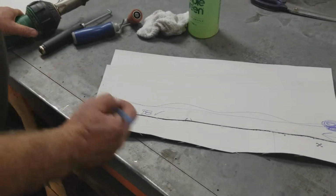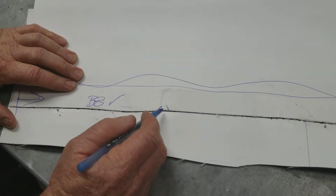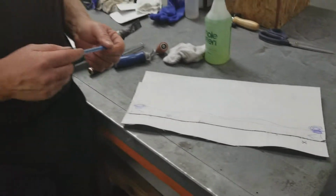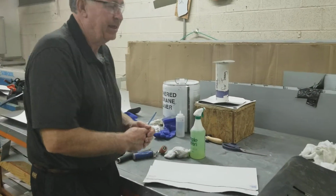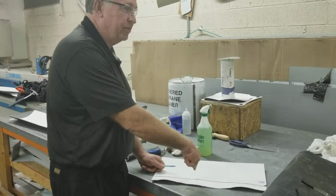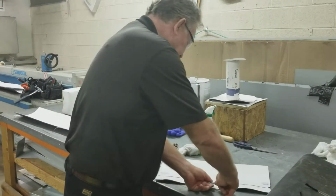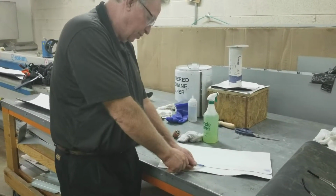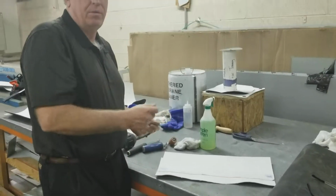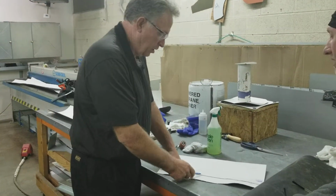But there's an extreme high likelihood that I have a void on that line and on that line. And so the thing that you almost need to do on welds like that, or repairs like that, is one, you have to have a pencil tip so that you can actually get your air nozzle inside that little void and be able to heat going that way, and then turn that nozzle to point it back this way, turn it back this way, turn it back that way, and then pull out and then roll it down with a pencil tip. So heat it up, pull it out, and then push the nozzle in further.